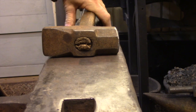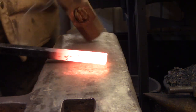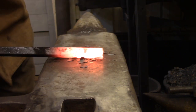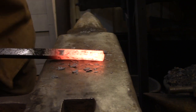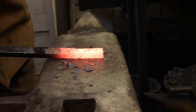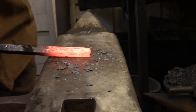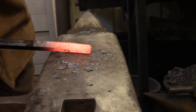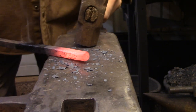The first thing you have to learn is that working in the center of the anvil with the flat face of the hammer is the most inefficient way of moving metal. That technique is only used for processes where we either don't want to move any metal at all, or we're making very slight changes to the shape of the piece. For example, here I'm turning a square bar into a round bar — I'm not making it any smaller, just driving the corners back onto itself to create a round bar.